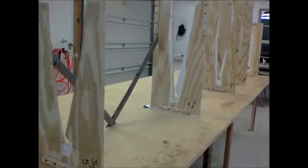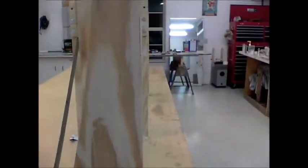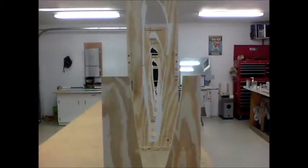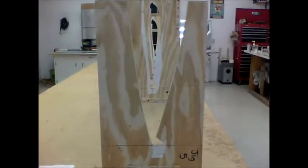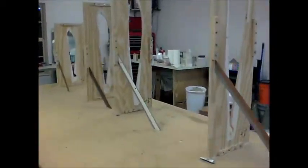I've got the jig set up according to the instructions. I did use the bondo like the instructions suggest, and I used little diagonal braces cut on 45 degrees with my saw, and put them all on this laser line. Looking through them, they all look pretty good. I double-checked them to make sure they're straight and plumb — I did have to put a little bit of shim in some of them because the table is not perfect.